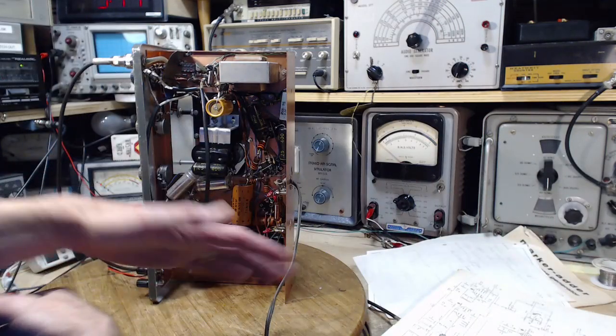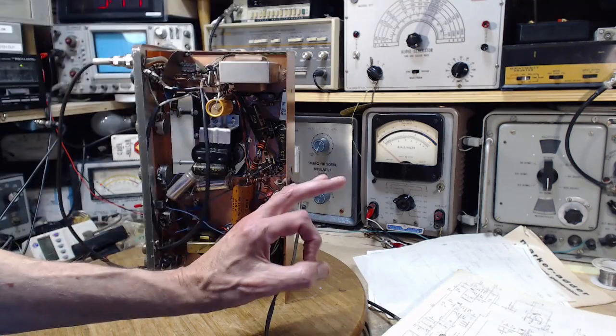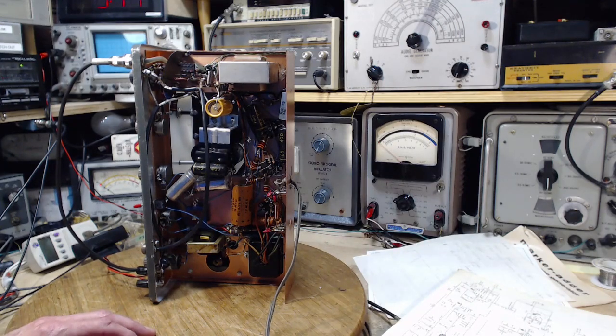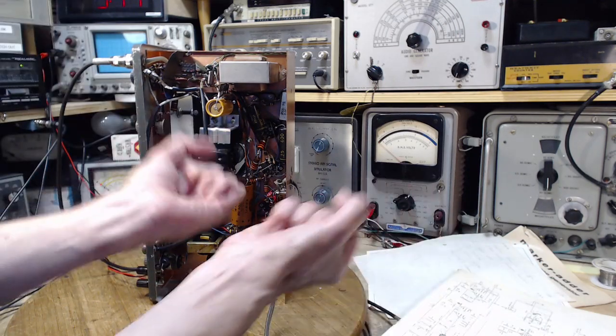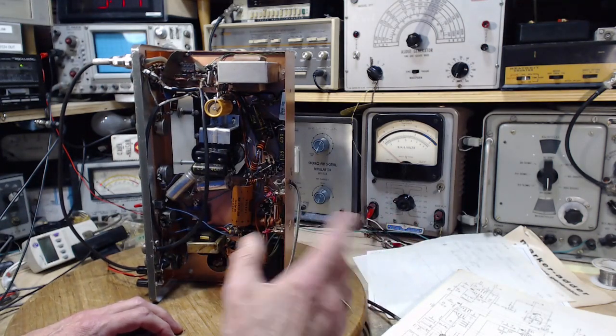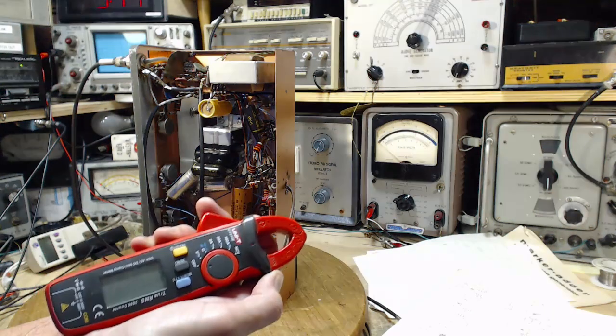You can find it in people's houses. If you live in the city of Toronto and you've got a clamp-on ammeter that can read DC, go do this. Go down, find your ground wire that ties the water pipe to the hydro neutral. Put your clamp-on meter on that. Set it to DC. I have one here that would do it. This guy, this guy reads DC.